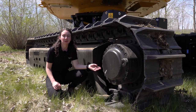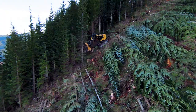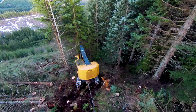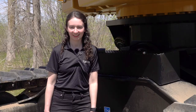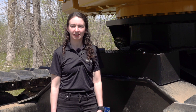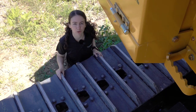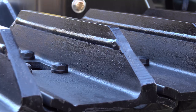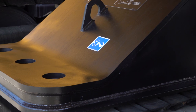It uses two massive hydraulic cylinders and heavy steel sections for a solution that is both simple and robust. The elongated track frames include an extra roller that increases the machine's footprint without compromising maneuverability. The patented inclined pin axis geometry of the upper pivot provides excellent stability when leaning to the side without the need for complicated linkages or electronics. This design keeps the machine's center of mass close to the ground, which also increases stability. An integrated toolbox is standard on all flat bottom machines and an optional bolt-on toolbox is available for leveling machines. There are many track options available ranging from 24 to 36-inch wide with single, double or triple grousers. Extended grousers are also available for leveling machines with 24 and 28-inch wide tracks. A factory installed cable assist mount is available on leveling undercarriages.